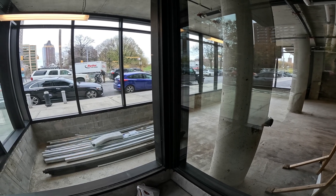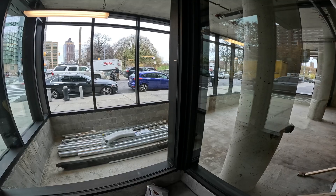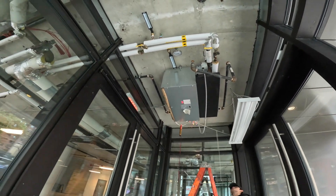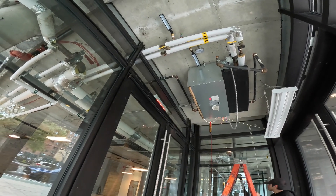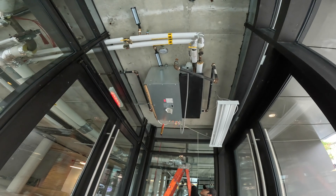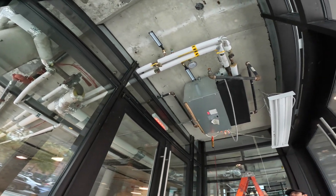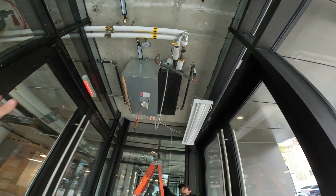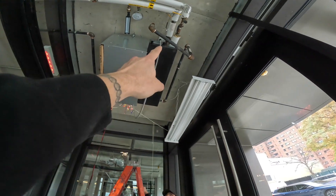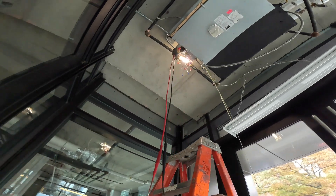I don't know what happened here, but clearly somebody cut the thermostat cable and tripped the transformer. We could put in a digital thermostat, a modern one, and then put a wireless sensor somewhere hidden — not on the outside walls or the glass, because I feel like this area is going to get a lot colder. The sprinkler sensor is right here — that's a bad spot. Any sprinkler guys watching this: you're bouncing hot air right across there. They've got to move that pipe.